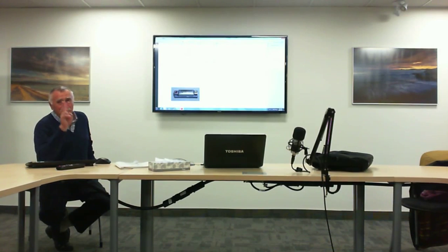So, what are the two things you can do to eliminate image frequency? One, make the intermediate frequency ever so large. Those ham radios you buy with today's technology put the intermediate frequency in the 40, 50, 60 MHz domain. The other measure is to use a roofing filter. The word roofing filter suggests a filter that looks like the roof of a house. It has sharp walls, like brick walls. It's called the brick wall filter as well. We use a filter so good that an image frequency interfering signal above or below has no chance to go through. So those are the two things we can do to eliminate image frequency.